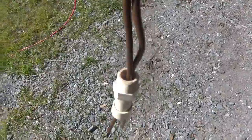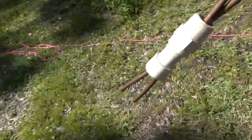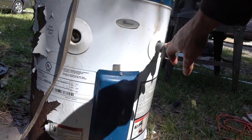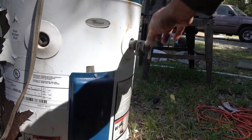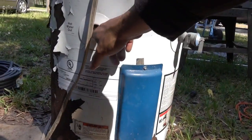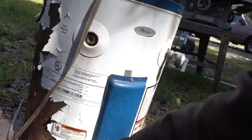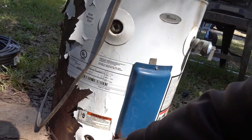This is the one heat exchanger I made for the video, and I'm going to show you the water heater. This is an old out-of-commission 120-volt electric water heater with a 1,500-watt element in here. If you work with these, never remove the pressure release valve, because it's always safe to have those. Ideally you can take these lugs out here — you have the same pipe threading — but as these tanks get older, this one is basically impossible to do.